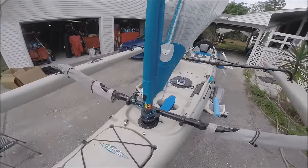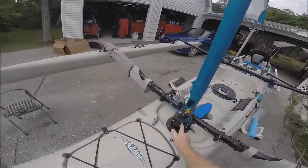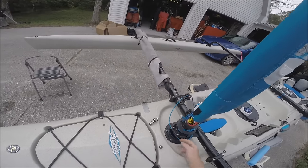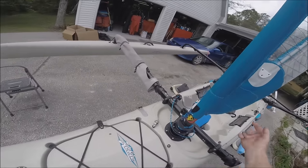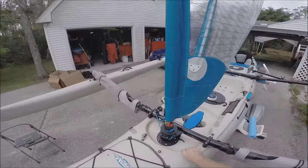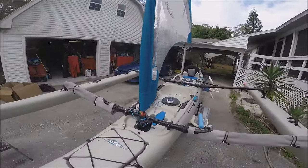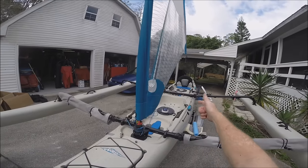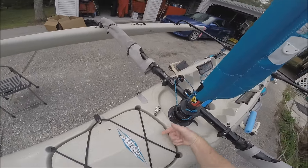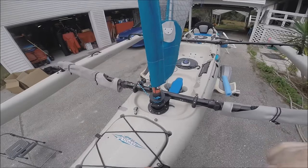The other problem I've encountered while sailing my Hobie is that while you're out there with the sail out, your furling line is pretty much wrapped around the sail. In rough seas, bouncing and tacking back and forth, this line will tend to drop down there. When you go to pull on your furling line to roll up the sail, it locks around the base and won't pull in your sail. If you're in the rear piloting and you've got a novice up front, you literally have to climb over your passenger to unlock and untangle it. It snags on the nuts underneath and creates quite a dangerous situation.